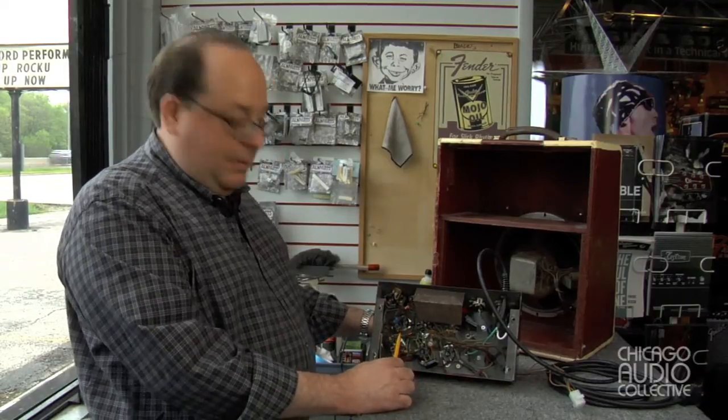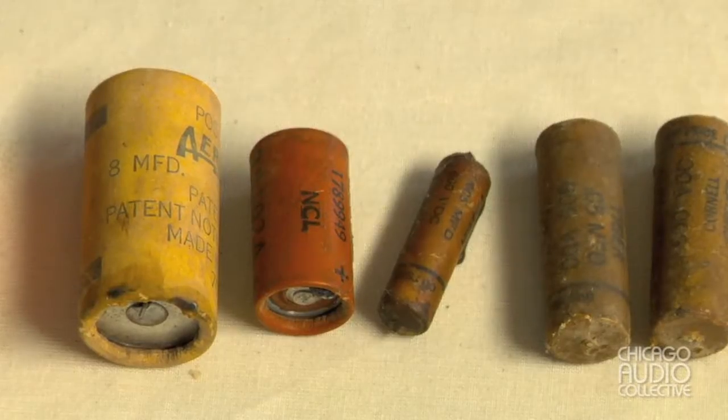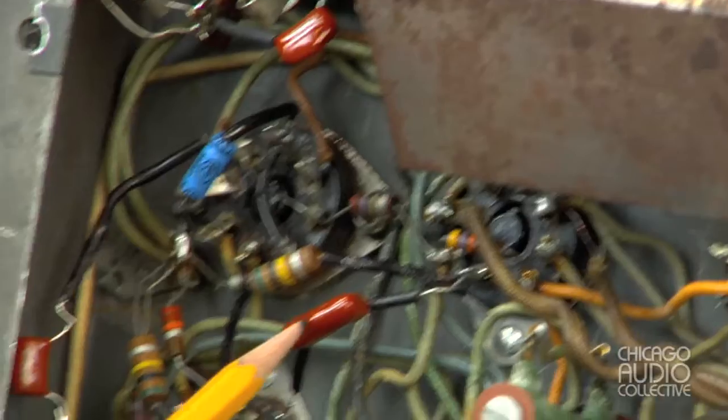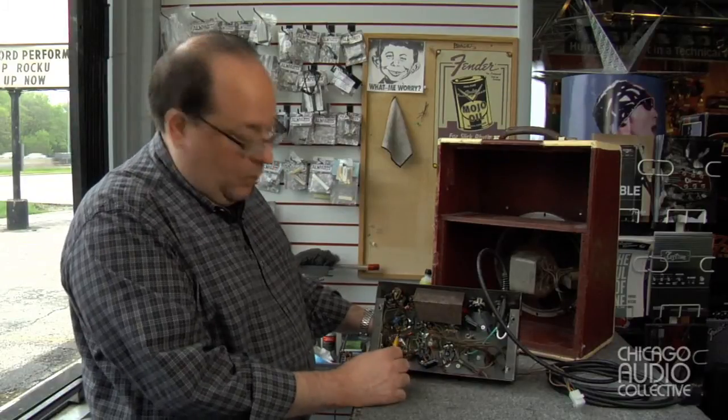In the case of this amplifier, like so many others, it had all of its original capacitors, and they were of a paper dielectric type which were completely no longer viable. We replaced them with modern replacements throughout, just as they did with insulators and point-to-point wiring.